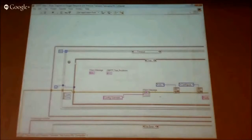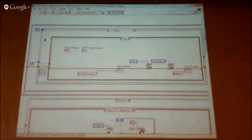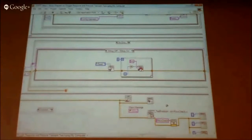The code ended up with a main block diagram. At the top there's a user event structure which just kept the program ticking over and handled some of the scanner interface. Underneath that we had a loop checking for the e-stop button — if that's pressed we just reset the device and reinitialize. So that was continuously running, just looking at the digital states.